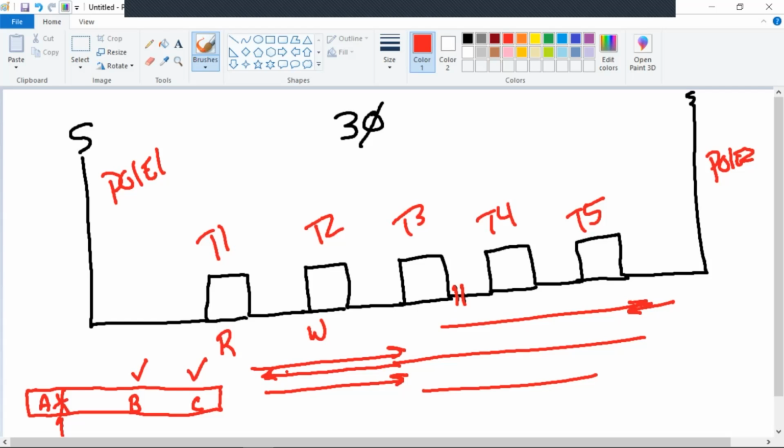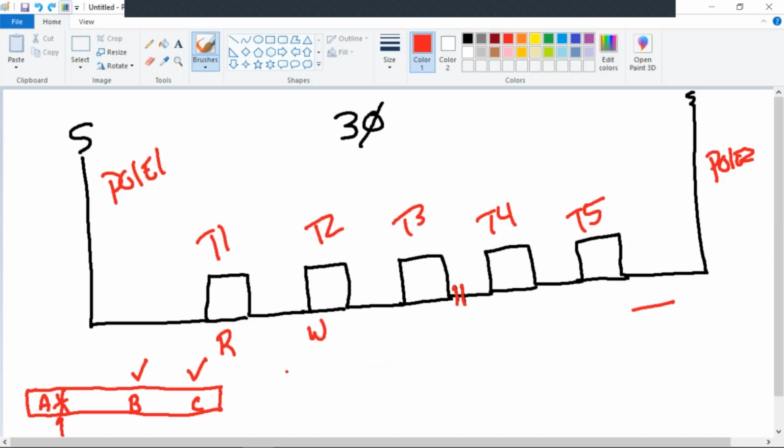All right. So the first thing that we need to do, if we have found that a phase is blown on this pole, is we need to open B and C. If you've lost one phase on this pole, B and C must also be opened. There's multiple purposes here. One, the exclusive one, is safety, so you don't have multiple feeds going multiple directions. The other thing is anything that's three-phase equipment hooked up in T1, T2, or T3 is not single phasing anymore. Single phasing, a loss of phase, can be damaging to the customer equipment. So that's the first thing we're going to do.